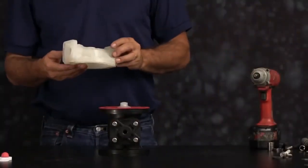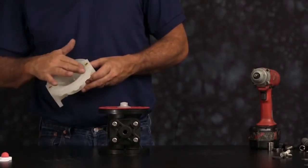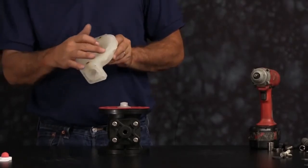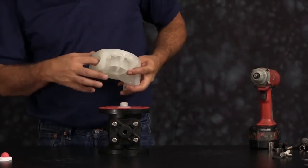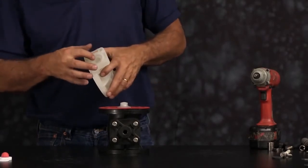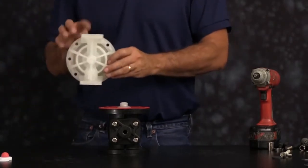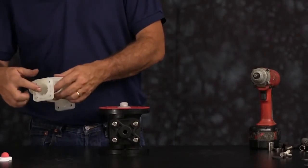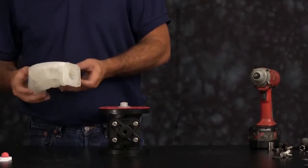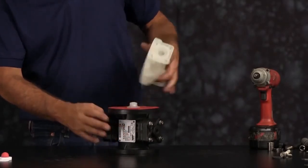Now we can install one of our outer chambers. You want to inspect the outer chamber. Inspect the machine faces and radius of the chamber for damage or material buildup. Scarring, scratches, or material buildup can be cleaned up by using emery paper, crocus cloth, or fine sandpaper. Ensure the radius on the inside of the chamber is maintained during cleanup. Replace the chamber if necessary. When aligning the outer chamber, be sure that the discharge port faces the nameplate.